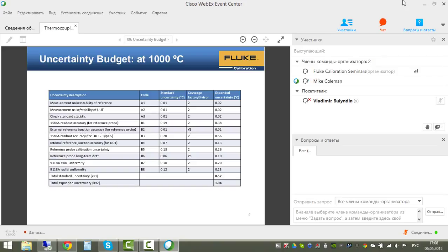The uncertainty analysis shows both the standard uncertainty and the expanded uncertainty for each component, along with the coverage factor or divisor used to convert from expanded uncertainty down to standard uncertainty. We show both columns in this webinar, which can sometimes be a little confusing, but we felt it helpful here.